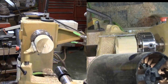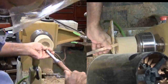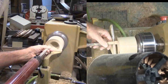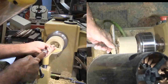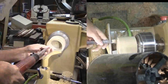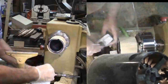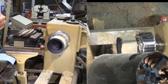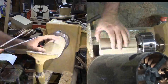Next I'll mark off some of the planned measures. Now to start hollowing the egg box top — I'll start with a gouge to hollow the end grain, then as I got deeper I'm switching to a round nose scraper. I also need to cut a mortise that I'll have to fit a tenon to a bit later. Now to sand the top's interior. Since the sanding may have affected my mortise, I'll dress it up just a little with a square carbide cutter. Since poplar's dull green and purple shades are not particularly attractive, I'm going to stain this egg black. The dye is alcohol-based, which makes it compatible with a shellac finish.